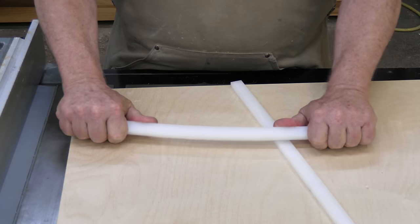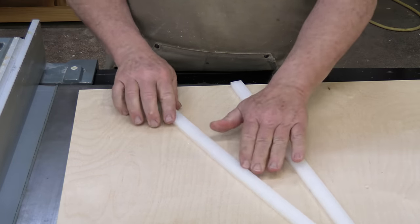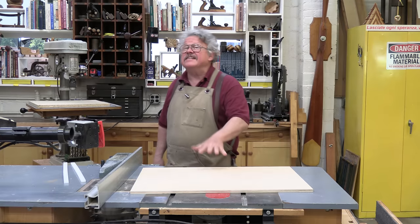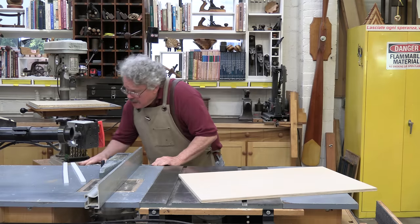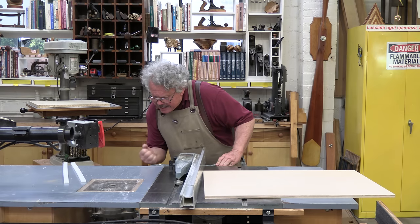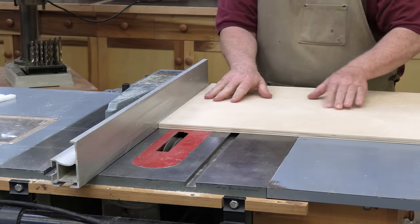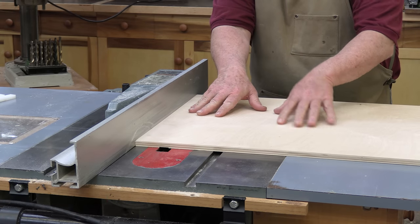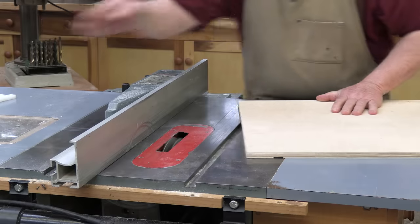Because I'm using plastic guides, I'm going to mount them in shallow dados. This will help keep them straight and true. This is also a good idea with wood bars. They bend a little too. It's not necessary with metal bars, of course, but the technique will remain the same, minus the dados. Cut the dado for the right guide bar just a short distance from the right edge of the sled. Don't cut the left dado yet.